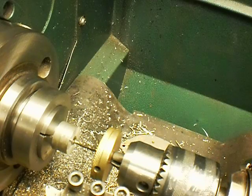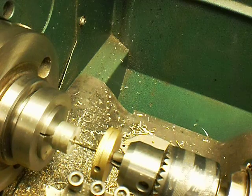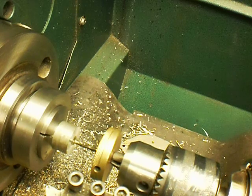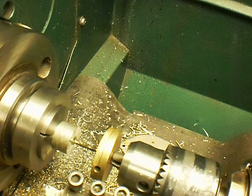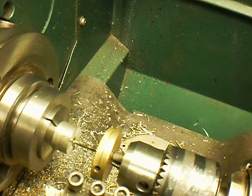It works so slick for power tapping. I've gone down to 3-48, which I think is the smallest that I've done it this way, and I probably could get by doing it on 2-56s too, but at a slower RPM. I'm running it at 1400 RPM, and basically I just hit the inching on my lathe, which is basically a momentary turn-on for the spindle, and then reverse it when I back it out.